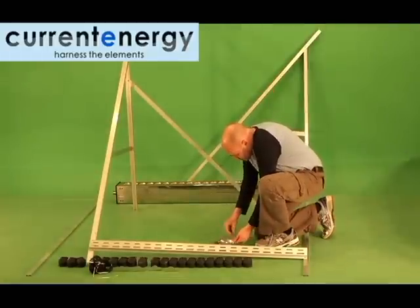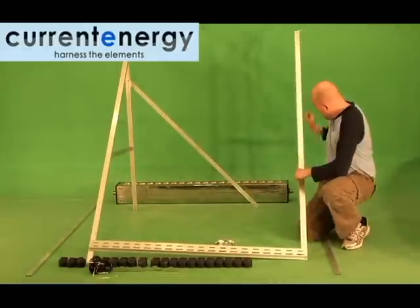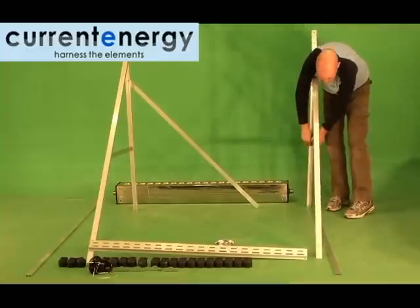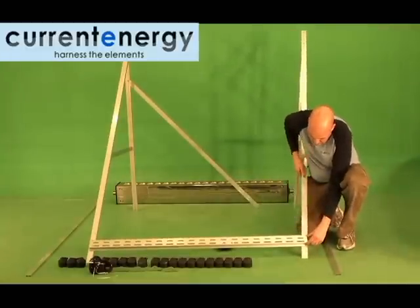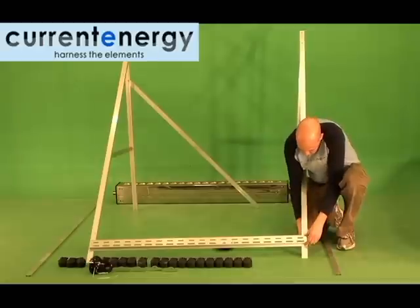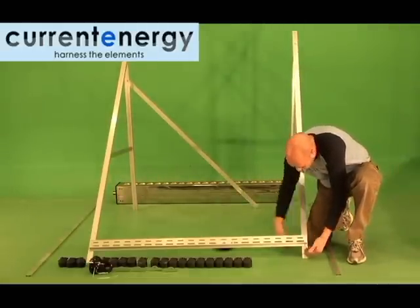When this task is complete, it is time to attend the next task. Attach the bottom bracket to the base of the front legs. The bracket can be identified by its multiple slots. The smaller slot should point upward toward the manifold, the larger downward toward the ground. When this step is completed, continue by attaching the bottom bracket to the remaining front leg.